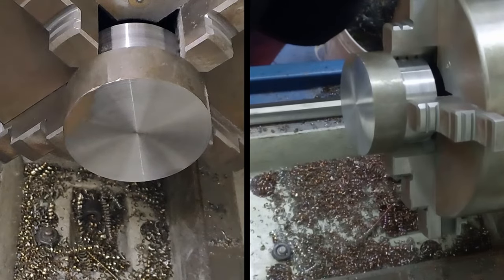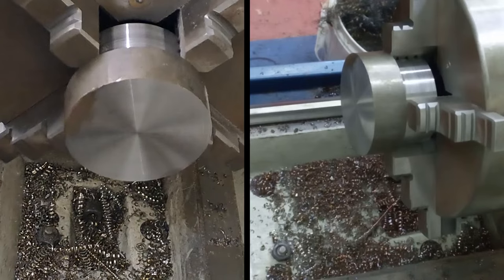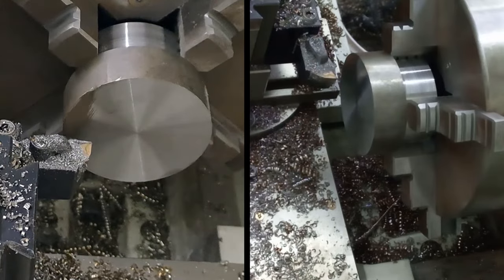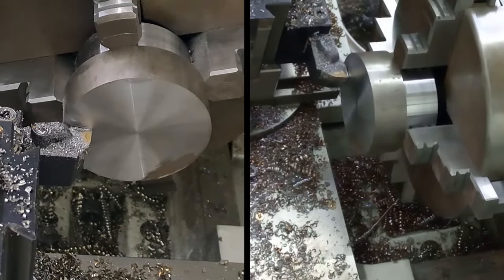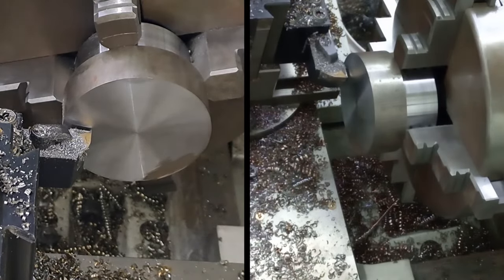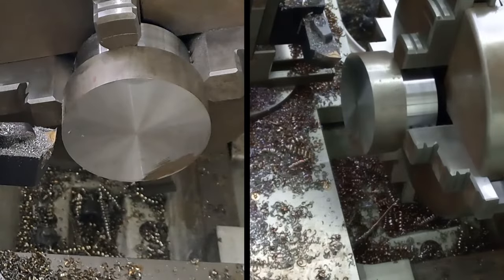15 mil is 5 whole turns and 115 divisions. I'll do the first couple of cuts, then I'll drop you out at that, guys. There's no point in you watching me do that. I'll bring you back once I get it down to 15. There's a fair amount of steel to come off this. I'm just setting zeros while I'm talking to you. So that's that one. Okay, right, don't need to worry about that one because it's going to be turned away. Right, here goes, guys.